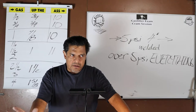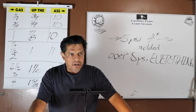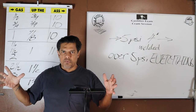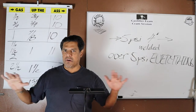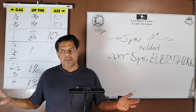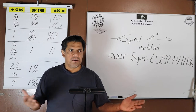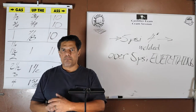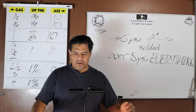There's always a but. But you've got a Scotch Marine boiler. A huge Scotch Marine boiler. It comes as a package. So the gas train comes with it because it's going to need regulators and valves and solenoids and all of this stuff specifically calibrated for that unit. And you're looking at it and it's all threaded and it's 6-inch. We can't have a 6-inch threaded fitting. No, we can't, except if it comes as part of the package on a boiler. So that's the time when you can have larger fittings on the gas train.